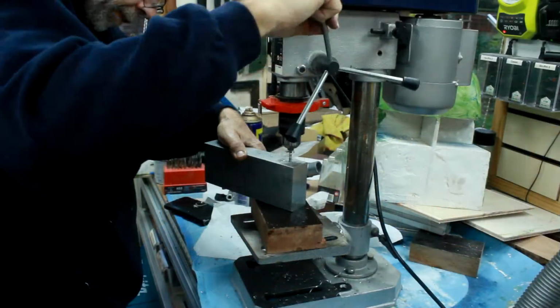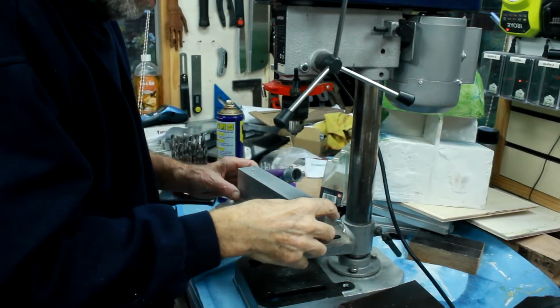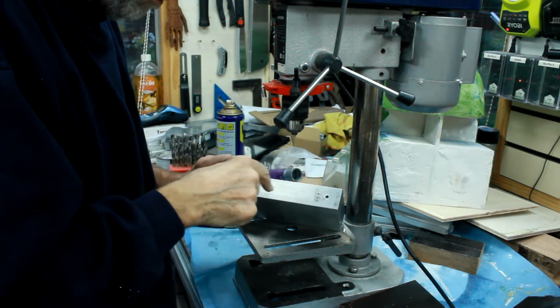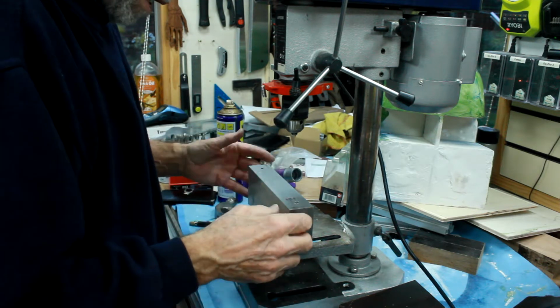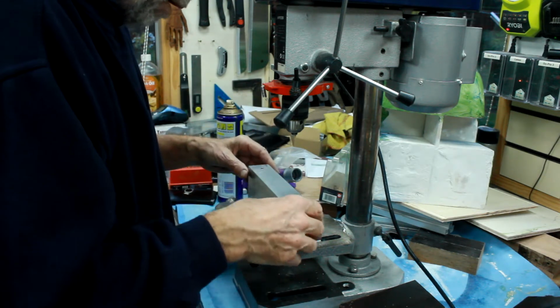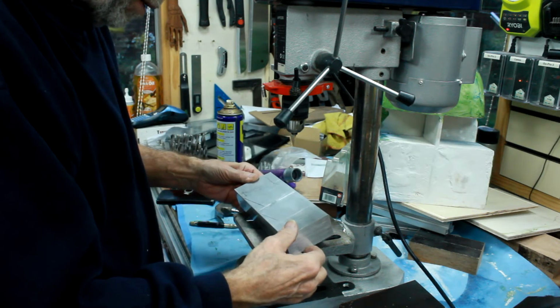So it's time to move back on with the Cyclekart and get this front axle ends sorted out and do a little bit of work on the billet aluminium I've got. So let's have a look and see what we've been doing on that. That's drilled the kingpin holes out, 4.5mm, and we'll make them larger when we need to, but now that hole is through the middle. A normal drill will just follow that and we can get those done later.